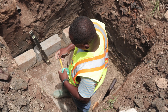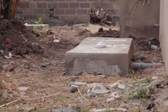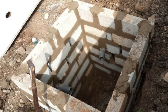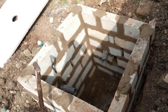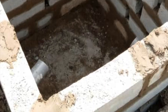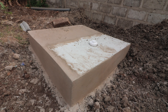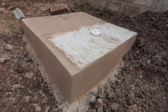When we started digging, we found it's mostly clay and it wasn't going to soak if the number of users exceeds a certain amount. The advice to the homeowner is that in a worst-case scenario, if there are more than seven or eight people, you may have to consider pumping the wastewater out. That means getting a simple pumping system linked directly to the overflow pipe, and if possible, connecting to a bigger drainage pipe.